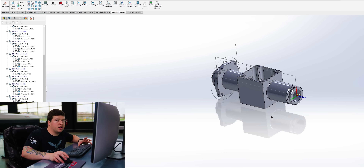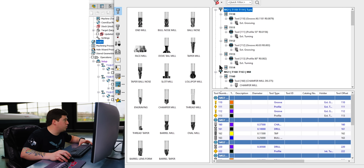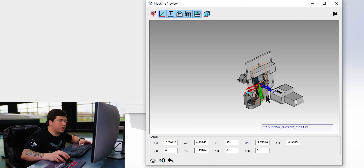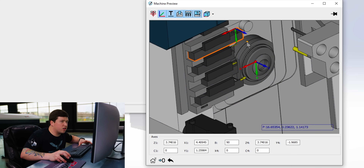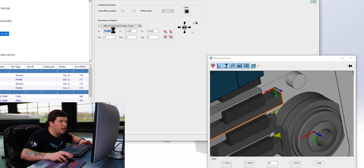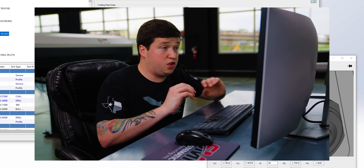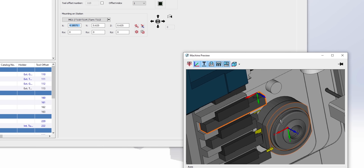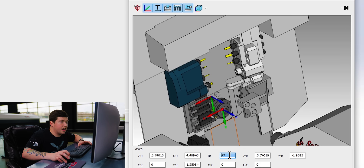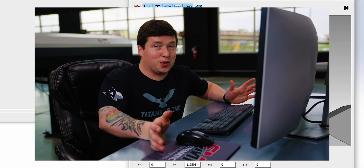Some of the cool things about SolidCam is how easy the machine is to set up — other softwares can be a real pain for this. In the toolkit, I can view what a tool looks like in the machine — it shows me the fixed ring points and all that. If I think a tool might not be sticking out far enough, I can roll my mouse and move the tool in and out to get it exactly where I want, right there, without having to pop in and out of menus over and over. Setting up your machine in SolidCam is light years faster than anything I've ever seen. I can go onto my B axis and swing it to see how things are going to clear, go into my X axis — I can literally play with the machine as if I'm at the control.